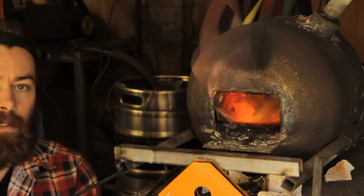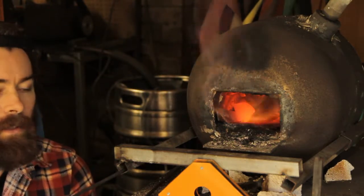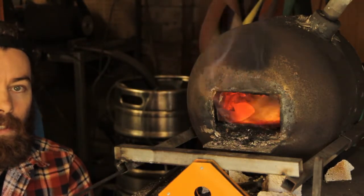I'm just going to test on my magnet. This is 1075 steel, so the magnet is a good way of working out if it's at the right temperature or not.